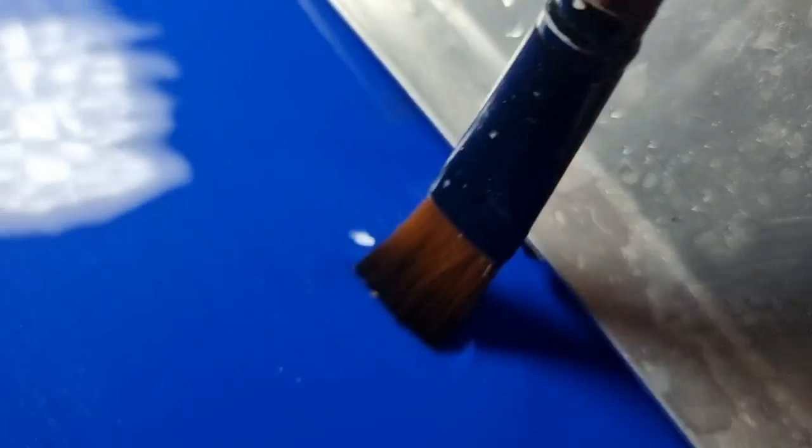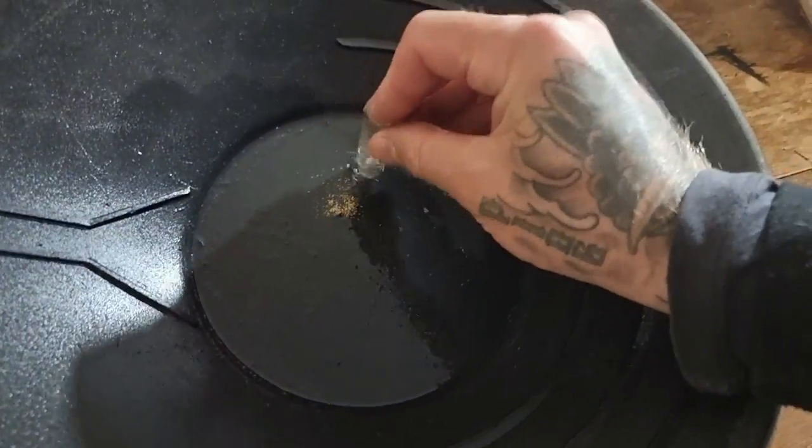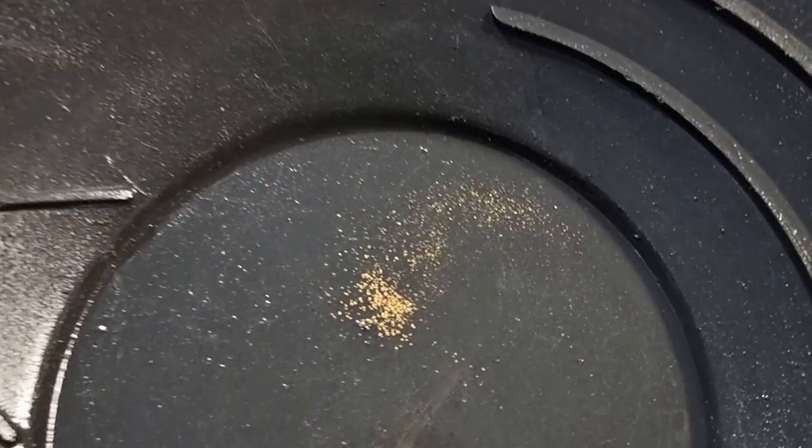There is no wonder I lost it — just look at how much it wants to roll. That's all gold and it just wants to roll straight off the end. There is a point of diminishing returns when it comes to making a modification like this. I can make the scratches deeper, but then I'm going to be creating turbulent flow, which is going to want to keep more of the concentrates. If I scratched it any harder I'd end up with too much dirt and I'd lose the efficiency of the machine. This tiny scrap of sandpaper helped me recover all of that gold. That might not look like a whole bunch — there's probably 0.1, maybe 0.15 grams there, $8 to $10 worth of gold. But multiply $10 by two cleanups per day, five times a week, and you're going to end up with $50 a week — that's $2,500 a year, or an extra ounce of gold recovered for one very basic modification to your miller table.